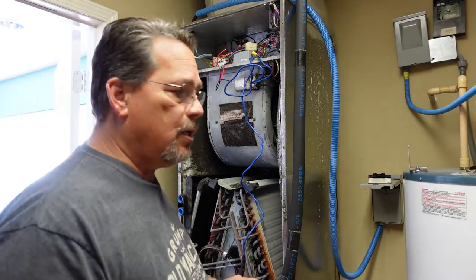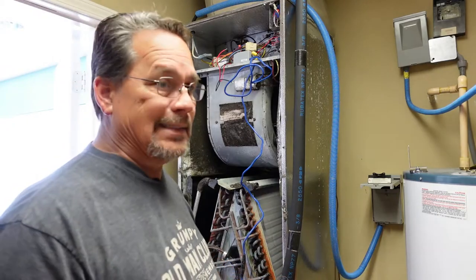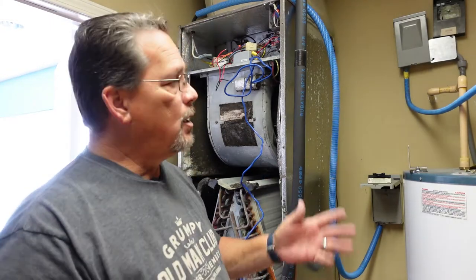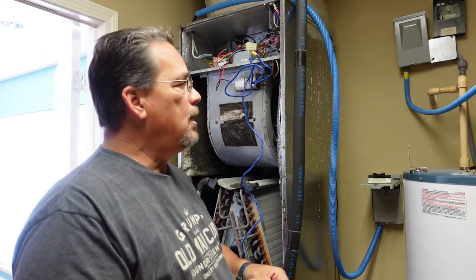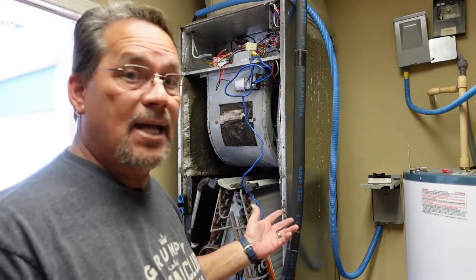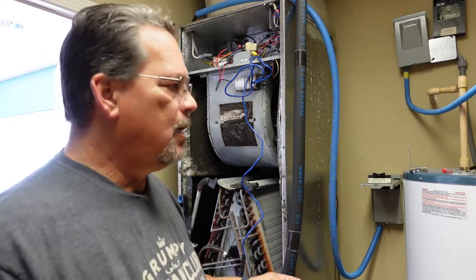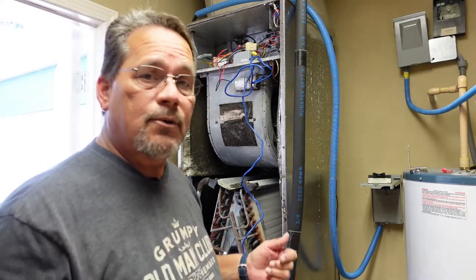We're opening the clubhouse back up and getting it cleaned up. We went ahead and replaced the compressor a couple of days ago, and while we were at it we put a new condenser motor on it because when we pulled the top off, water just flowed out of that motor — I'm not going to trust that, so we replaced it. A five-ton compressor and a condenser motor later, we've got this air conditioner back up and running. I figured this is a perfect time to show you how to install this UV light. It's supposed to help with the microbes and bad stuff that grows in your unit — the molds, mildews, and algaes. It cleans up your air and I'll leave a link in the description.